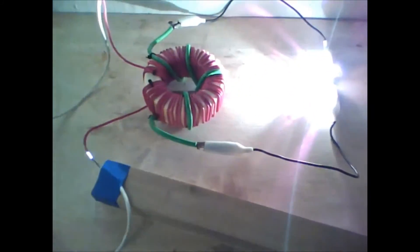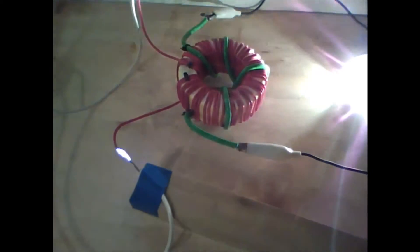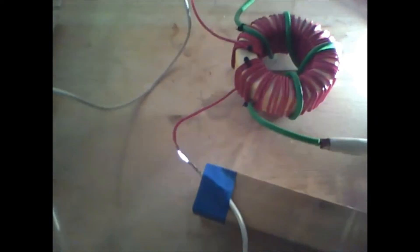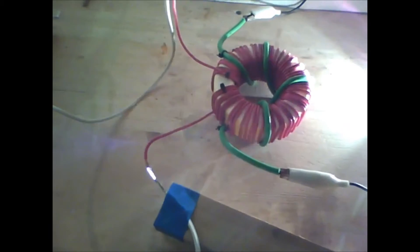You have to fluctuate the arc. You'll notice the light — right here is the brightest it can get. That's full brightness. 50 watts, 12 volt power coming out. My little meter over here — you can see it's reading like 76 to 77 watts. The fluctuation goes up and down. But this is pretty cool. You can actually compress high voltage — that's 12,000 volts going into that toroid. There's only three turns of winding and I'm getting 12 volts and 50 watts of power out of it.